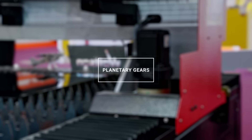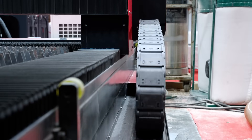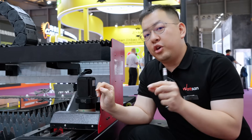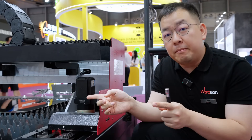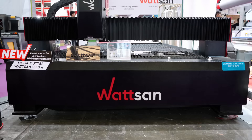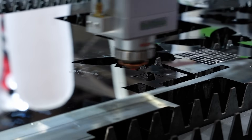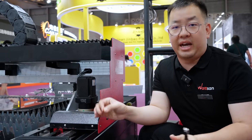Planetary gears. These allow the machine's gantry to reach the highest speed without losing control over motion. We use the Nidec-Shimpo gears of different series — VRB or VRS — known for precision and first-rate ability to deal with overhang loads and continuous duty cycles.